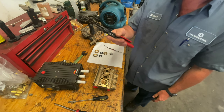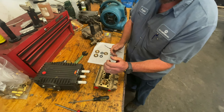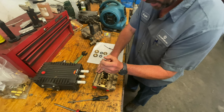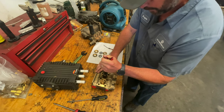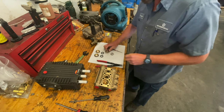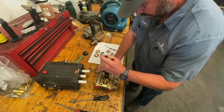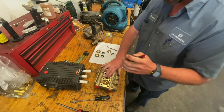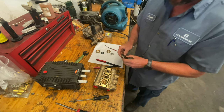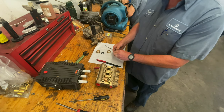Something that'll be handy is a pair of reverse pliers. When you push them, they put tension out. I'm going to actually have to use this on this one to help get that seated down in there. You can pick these up at any auto parts store — we typically get them from O'Reilly's. There we go. Low pressure seal back in, our packing retainer. Number two done, and now we'll do this third chamber.